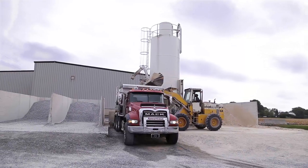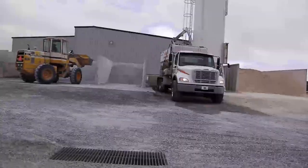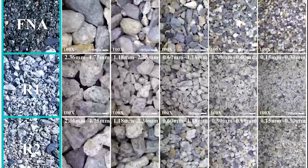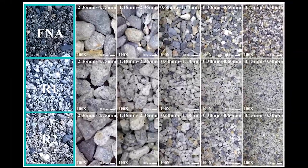In a like manner, the fine and coarse aggregate will vary from quarry to quarry. Another factor to be sure of is the size of the coarse aggregate. If more than one size will be used in production, each size will need to be calibrated.